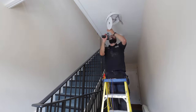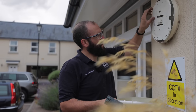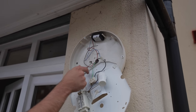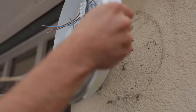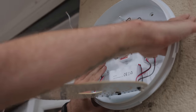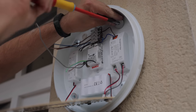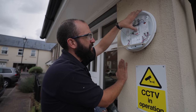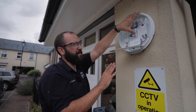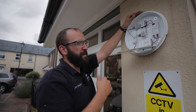This is the last one I've got inside - just having them all with their covers off so I can do the walk-by mode to set them up. I've just got one more to connect up outside and then I'm going to be going through the switches. This outside one has got a photo cell built into it - someone's wired a photo cell into it, so when it gets dark it brings this light on. Our new ones have a built-in daylight sensor so we can set the lux. We don't want this one coming on constantly because it's daylight and it's not needed, so we'll set the lux accordingly. You've got 2 lux, 10 lux, 25 and 50 lux, or you can disable it and it will just turn on and off regardless of light levels. So we'll set this up so it's not coming on until around dusk, and it'll save them even more electricity going forward.